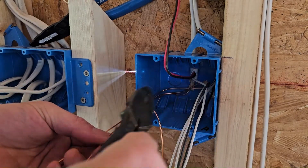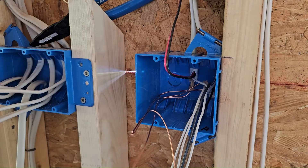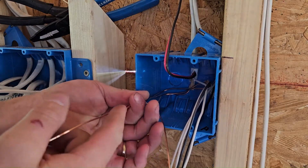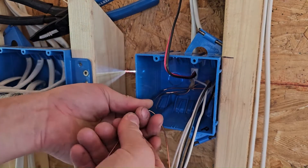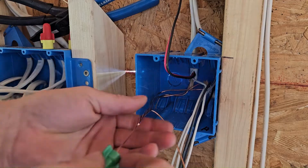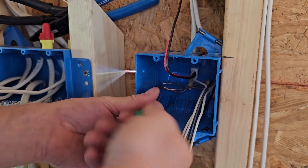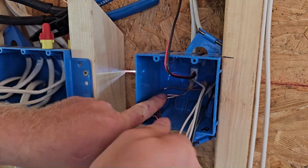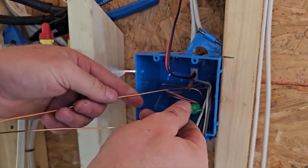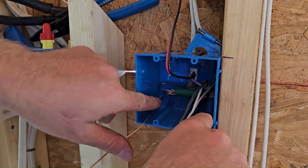We have our six inches needed, and with the extra wire I'll cut it off the same length as the folded one — just barely past it, which helps it seat well in the wire nut. Take the green wire nut, slide it through over that remaining wire, and twist it all on. You still have the required wire length for code on the cut one, and the others are nicely twisted. Then fold it up and out of the way, forming wires neatly for easy switch installation later.